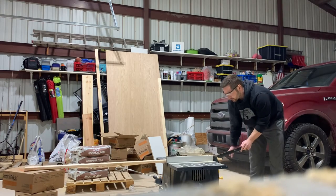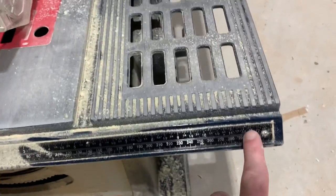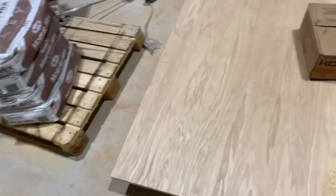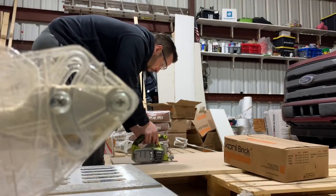Right here I'm ripping the back pieces — not the bottom I just measured, but the back. That ended up being about an inch and a half to two inches. For the front piece it's 14 inches wide, but my table saw only goes 12 inches wide, so I'm going to have to use the trusty circular saw to cut this down into sheets.